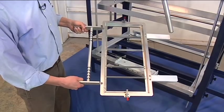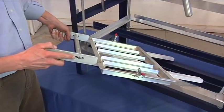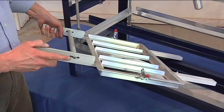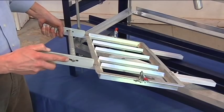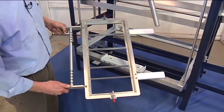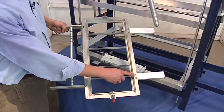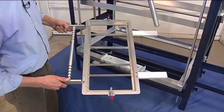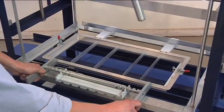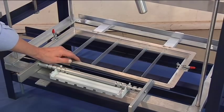Please remove the plug tray rack from the box, taking notice to the side of the arm where the screws need to be tightened and positioned in the center of the slot. For future reference, these can be adjusted for fine-tuning of the transplants. Depending on the model of rack that you have or the type of plugs that you're using, you may need to attach the support blocks in the back of the index rack itself. Once it's assembled, please put the rack in the proper place anywhere along the indexing block so that there's support for the punch plate.